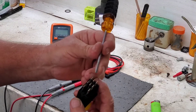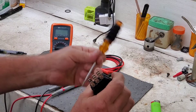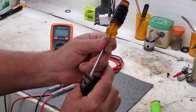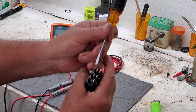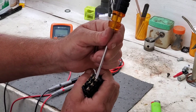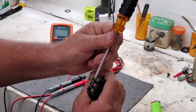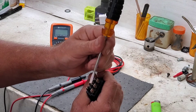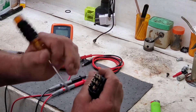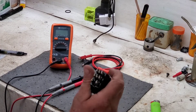Now this is connected to this right now. When I pop this switch out, instead of being connected there to there, that is open now. And then you close — not on the NC side, it'll be on the COM side. When you pull that switch out, you connected that to that, and that to that. And nothing here, because there's not a terminal there. All these switches are different with the amount of blades and everything, but they all pretty much work the same.